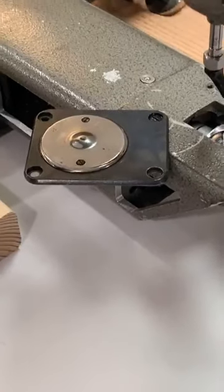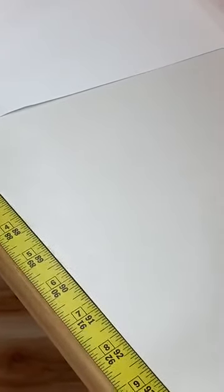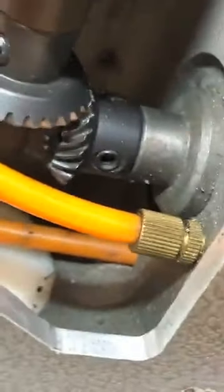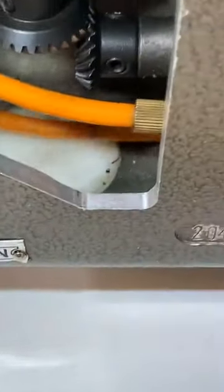Let's see if there's some things. Why do I get oil out from under the back bottom of the machine onto the table, maybe the size of a big drop? Oh, and that is normal. These bushings are not 100%. Come back here and I'll show you. In the back here, you can see this casting is all just like one reservoir. When you look down at the bottom just a little bit, it's just going to lay down in there. Sometimes that oil comes out of those bushings and it lays back down in there, and that's normal.